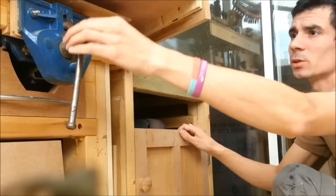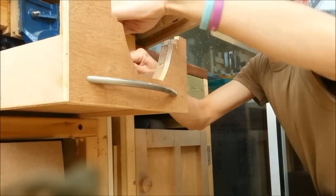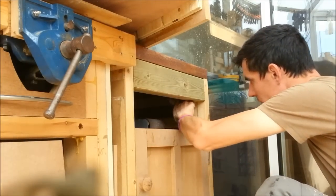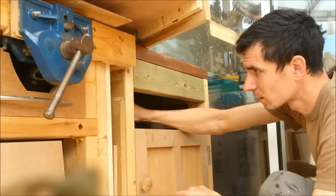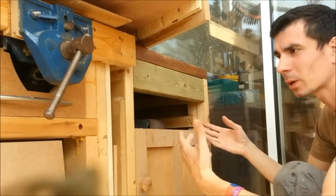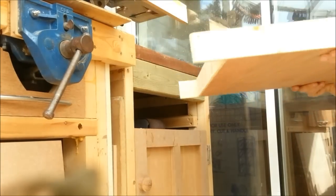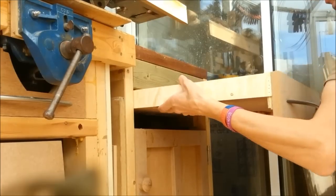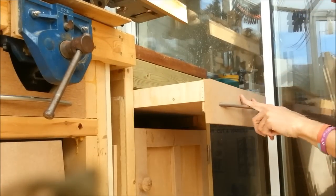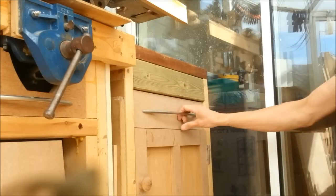The other thing I've done is use a wax candle — I keep one in this little drawer here, just an old candle — and I just rub it all over the runners and on the underside of the drawer to give it a bit of lubrication so it runs more freely. Now put the drawer in, and because of those top guides it doesn't drop out — it runs nice and freely.